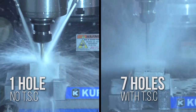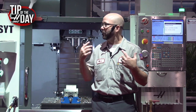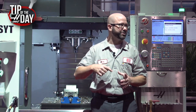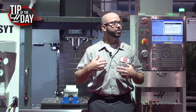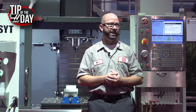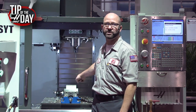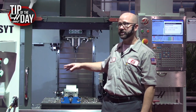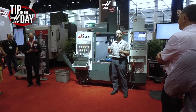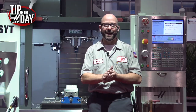Now switching to carbide would have allowed us to go faster RPM anyway. Carbide can let you go super fast, but still you can't just run a carbide drill straight to the bottom of a hole — you need the through spindle coolant to get the most out of those carbide tools. As a machinist I can see right away I can go faster: seven to one by switching to a machine with through spindle coolant. So depending on your part, check out TSC. Thanks for watching this Haas Live Tip of the Day.